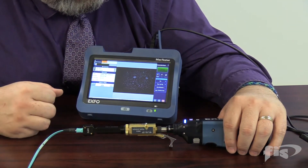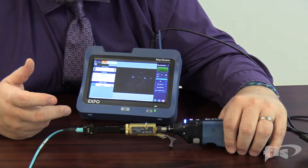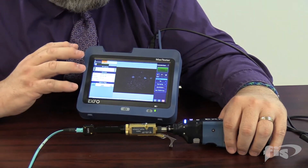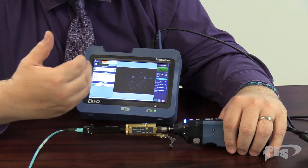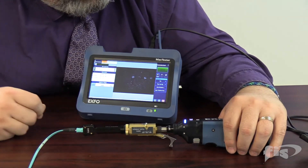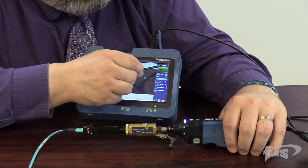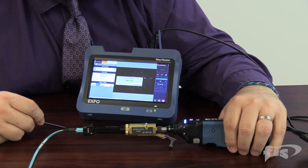Boy, these fibers are terrible! You can see a little bit of the alignment hole here — this is a female, so you can see the hole there. In our setup under user preferences, there are a couple of things we can set up. We've set this up to do groups of four. Another preference is 'don't continue if there's a failure' — so if you see a bad connector it won't move you to the next four because it already knows it failed. We would capture these four and you can see it's saving and evaluating each end, which are terrible.